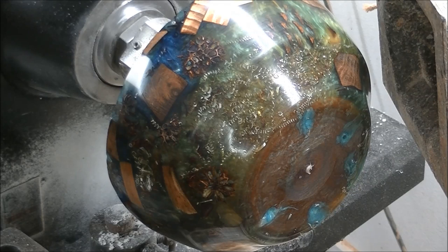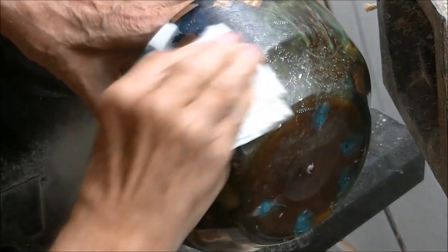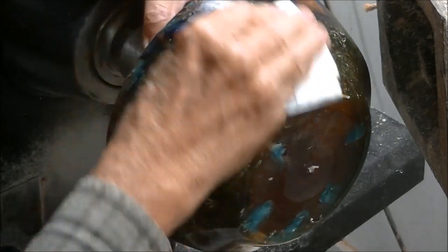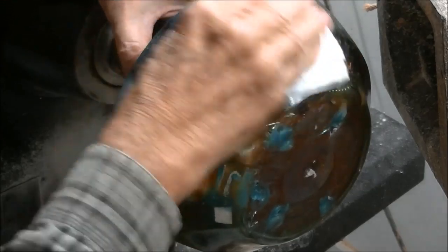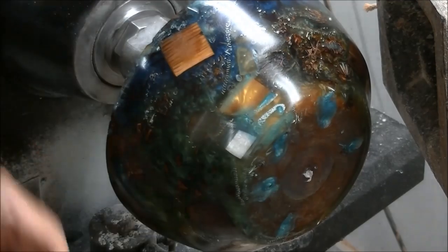All right, I got about 4 coats of sealer on there, Minwax sanding sealer, it's a cellulose water-based sealer. Now I'm going to try a little bit of paste on it. And you know, after each one, I steel wool and use a scotch pad on it. I don't normally do the outside, but I'm going to this time because I'll have to do it over again. You always do. But you can get it close, then it's not near as much work to do it over again.